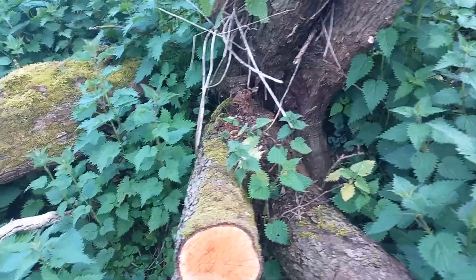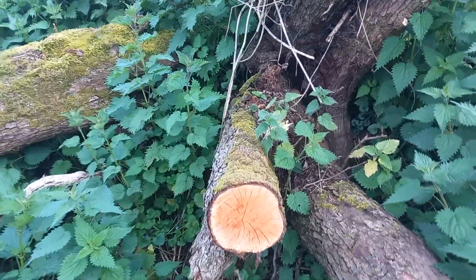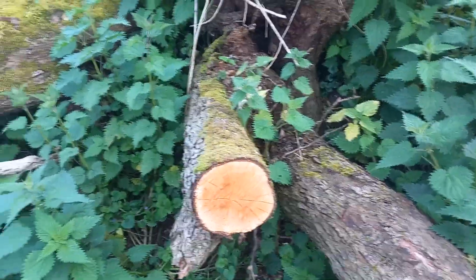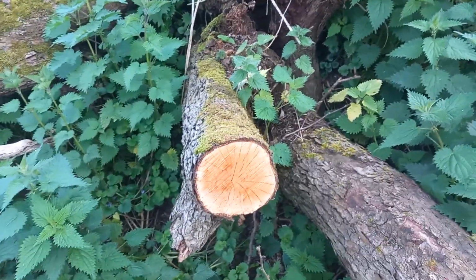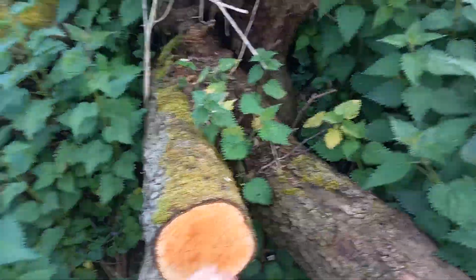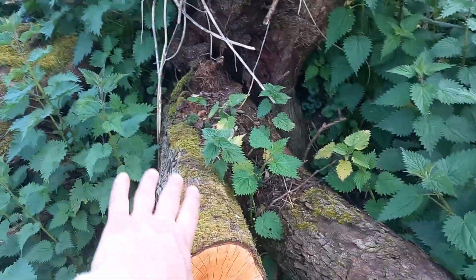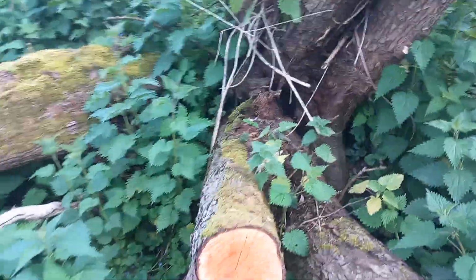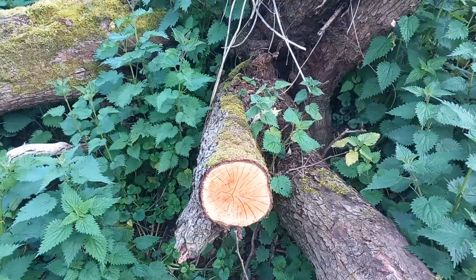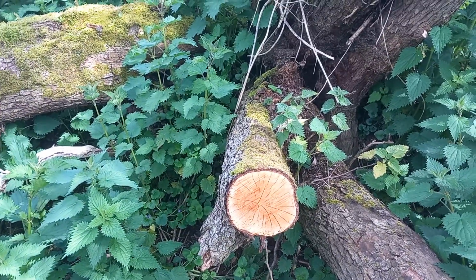Then you can get a thing called infusion epoxy resin. So what you do, my suggestion would be one of two colours, possibly brown as well. Mix some black in it, so you've now got a black epoxy resin infusion mixture, and stand it on its end, so this is facing upwards, and dribble the epoxy resin into the cracks, so that you fuse the wood back together again. It's all glued back together, it's got integrity, there's nothing weak about it. And anyway, these things are strong off the scale. That's way stronger than what is ever needed anyway. You can use wood structurally with cracks in it.